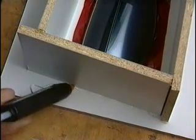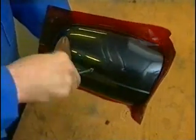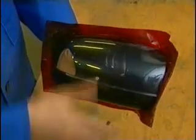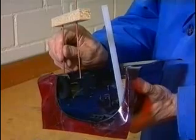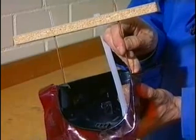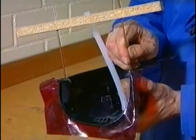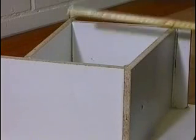In a second step, the gates and risers are adjusted. Small and lightweight parts can be suspended at the riser alone, while we recommend a solid 3-point suspension for bigger parts. A 2-millimeter diameter hole is drilled through those parts that are highest during the subsequent casting process so that a steel wire can be fixed here using superglue.